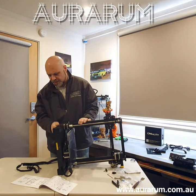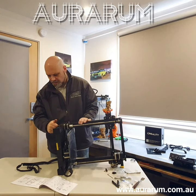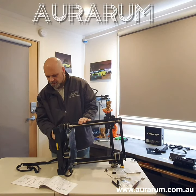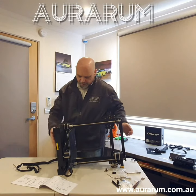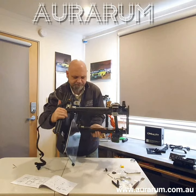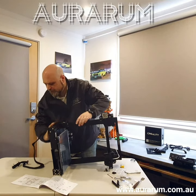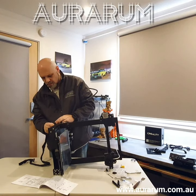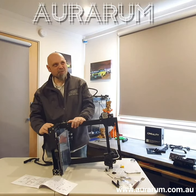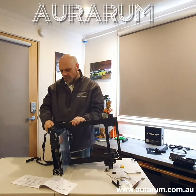The first step was install the gantry. Twist the coupling to raise the x-axis to the position as shown in the picture. So in this case, we need to bring the x-axis down. X-axis bottom profile. All right. Side now. Try not to rest that on the cables. So we're just doing those up to the point where they feel nice and tight. There's probably a torque setting you can put those to, and that's step one done.